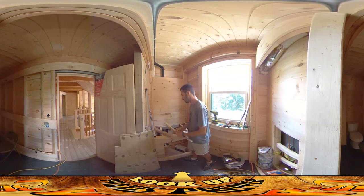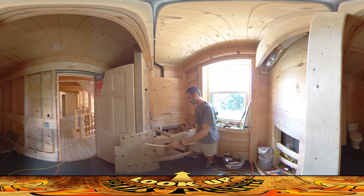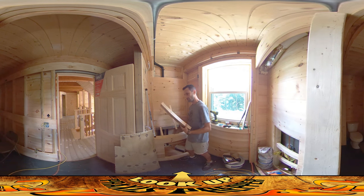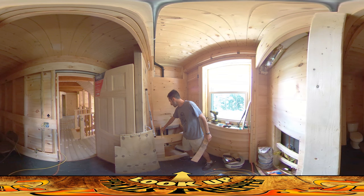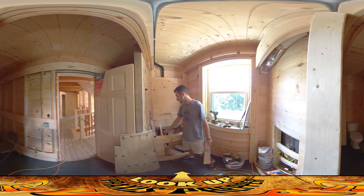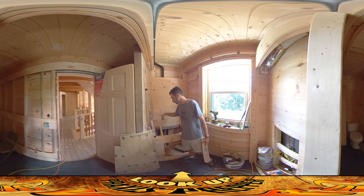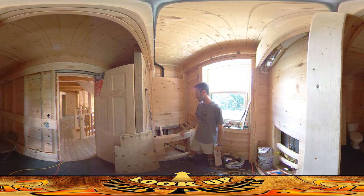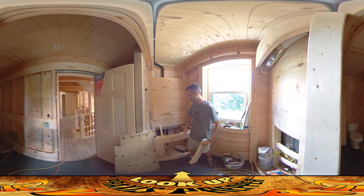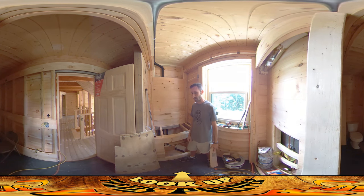The method I'm going to use is making little spacers — this side's high, this side's low over here. Wherever I've got these screw-down surfaces, I'm going to be putting these little pads in, just cutting them off a piece of two-by-four, and that will slowly raise up one side over the other. When I'm screwing this in, I'm going to make pilot holes as I drill through, because if I just put a screw right through here there'd be a tendency for this kind of wood to just split out. I'll drill pilot holes through this and through that before I sink the screws in, just to make sure they don't split.